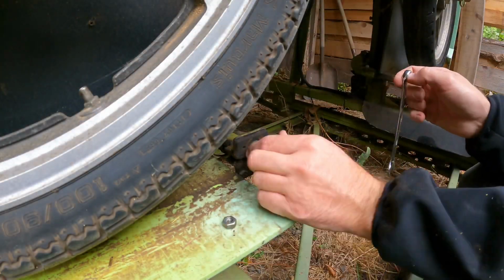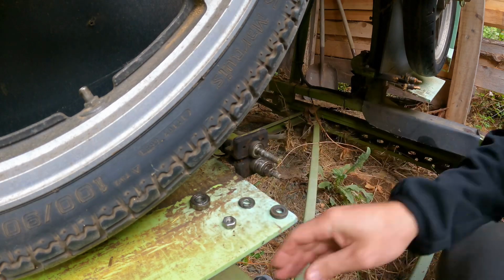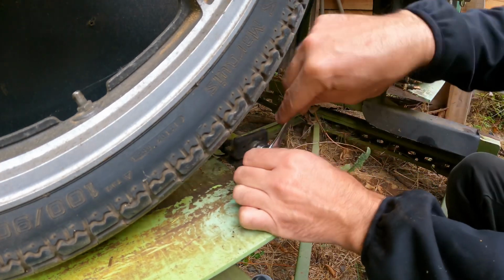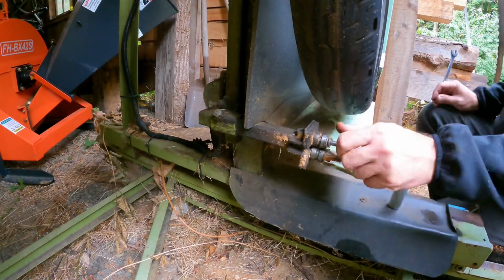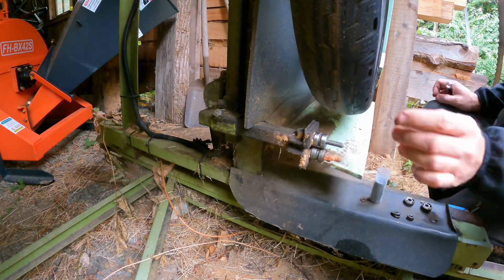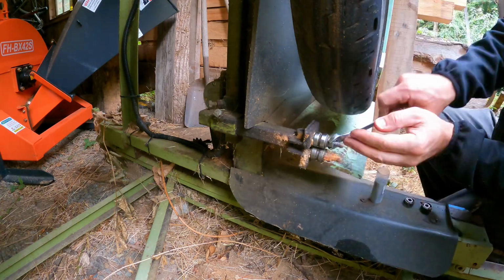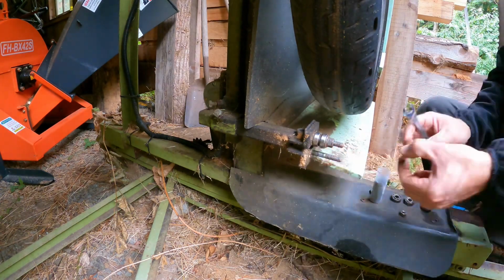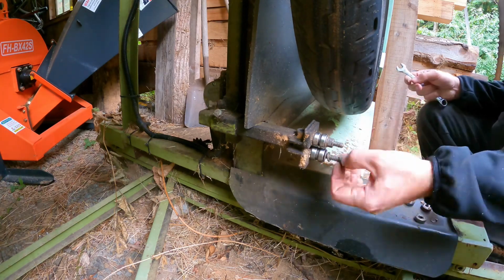So if you go back through and watch the original video of me building this, you'd realize the blade guides looked a lot different. Originally, before I had these ball bearings on there, I had UHMW skids for the blade to run on, but they wore out too quickly and had to be adjusted commonly. So I retrofitted it and put these top and bottom bearing guides. Works far better. They are a much better improvement to the mill.